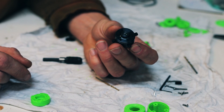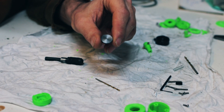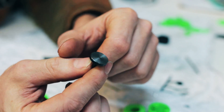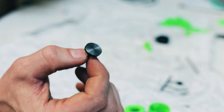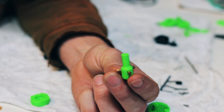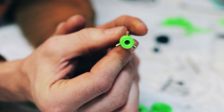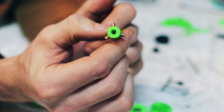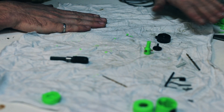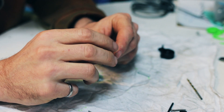This right here is the only piece that keeps surviving. The top little plate took a beating again this round. The carbide tip on the mill drill I'm using as a chamfer chipped off inside of it. I don't really use that tip because it's a chamfer, so no worries. I threw it in the lathe and flattened it off again. This is the center post out of the tool setter — that's where the platter fits on top. The probing post has three brass or metal contacts embedded into it. It needs to be plastic because of the way the switch works in the probe. The center post is the switch contacts, part of the switch assembly.